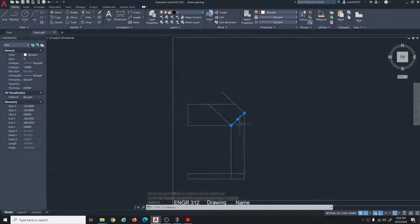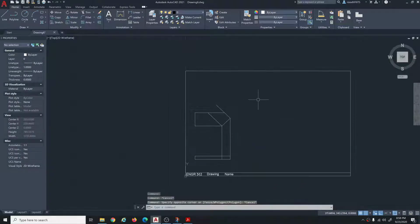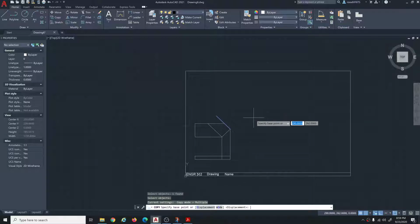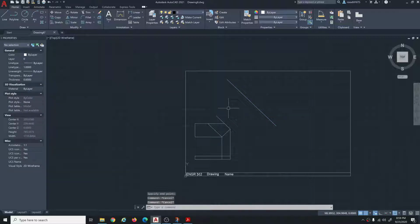That much is correct. Here I don't know this distance yet. And I can't draw really any of the flange in the front view yet, so I don't know any of that stuff yet. So let's do some projection to find this stuff. Let me move this stuff down a tiny bit more. All right, let's copy this line out here. Just enough space to fit in the first auxiliary view. So we have to start working on the first auxiliary view. Okay, then I'll start projecting from each one of these points perpendicular to this thing.